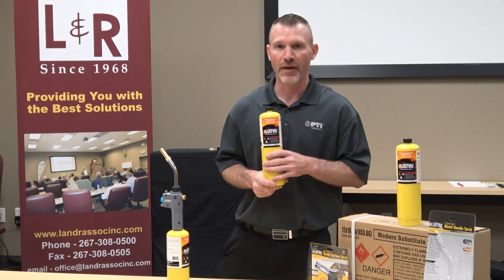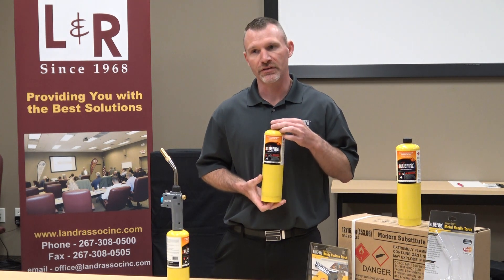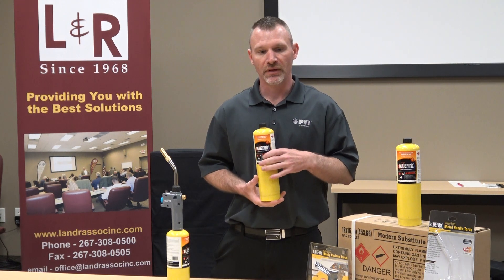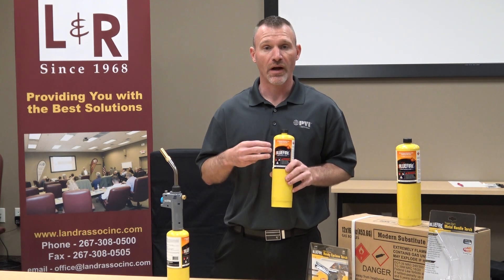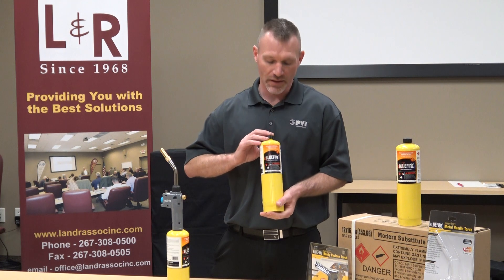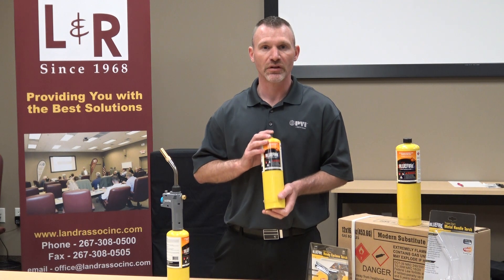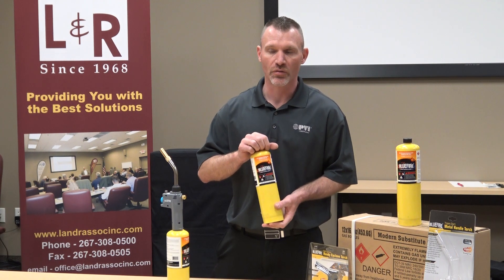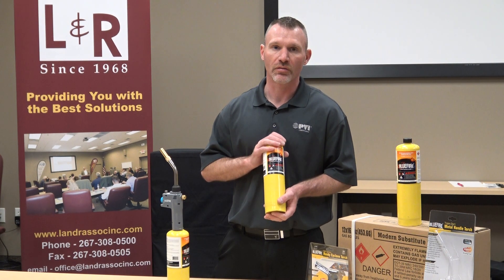Not to mention we're burning about 30 degrees hotter than your MAP Pro. MAP Pro is what other manufacturers like TurboTorch are putting out — Worthington's label says MAP slash Pro, which is a propylene-type gas mixture. We use a three-component compound that is lighter in weight, so we get more in the can. Again, 14% more in a can — 30 to 45 minutes of extra burn time for the contractor. That could be huge if you're doing a renovation or emergency work and need that extra bit of gas to get through.